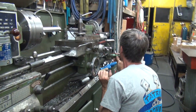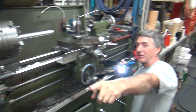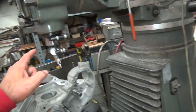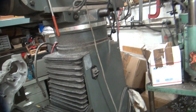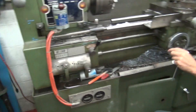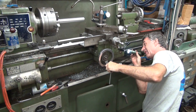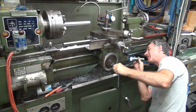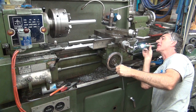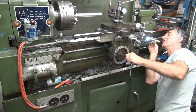The lathe was better quality than the mill — the mill was a piece of crap, really bad. We had to rebuild every piece of that mill. She went to sleeve the quill — the column that goes up and down. Had to sleeve it — it was a Willys Jeep sleeve. That's the size of it — we're perfect. We had to hand cut it and make it all work. We had to sleeve it right from the middle. So we put a new screw on it and just a bunch of stuff.